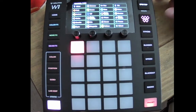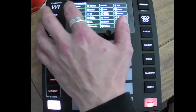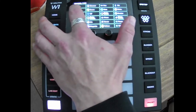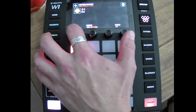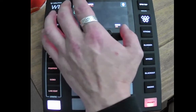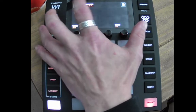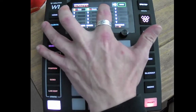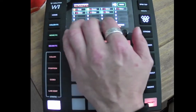We know a simple RGB fixture is going to be red, green, and blue channels, or with a dimmer on it. So the first channel is going to be red — just check that the values are there for 255, and it's a beam. We go back to that page and set green for the second channel. Then back to the channels page and the third channel is going to be blue.